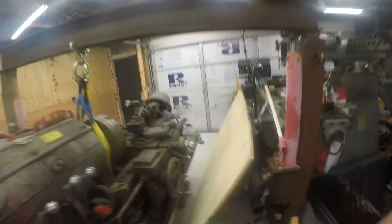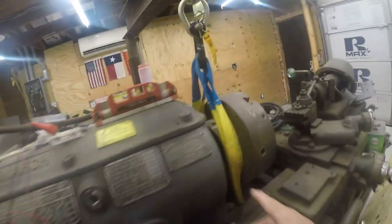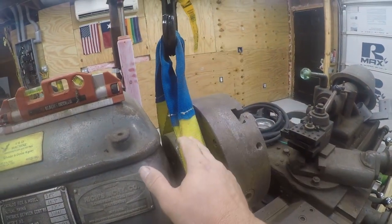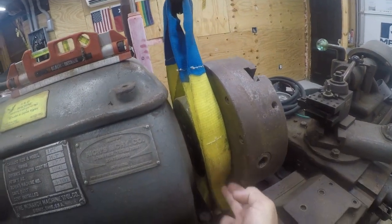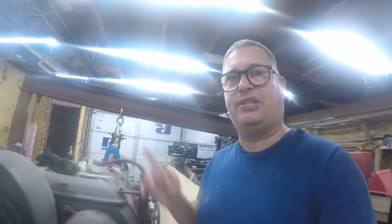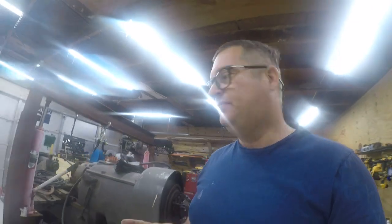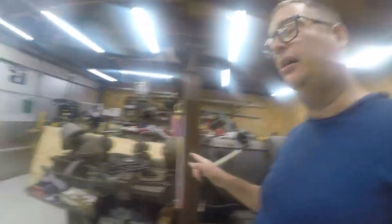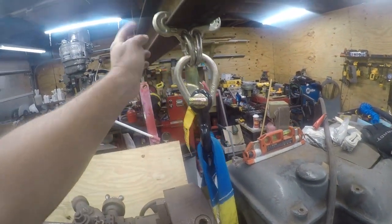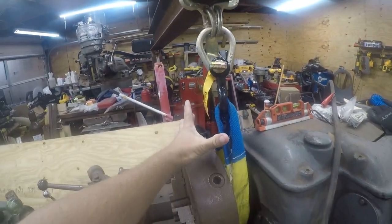The way this works is we've got a lifting sling that's rated for twice the weight of the lathe. It goes past here, and then we're using blocks to pick it up by the ways. That keeps the stress off the spindle — spindle bearings are not rated to pick the machine up. And then we're using rated hardware; it's tagged, all legitimate lifting hardware.